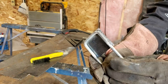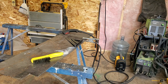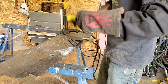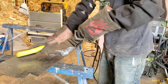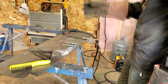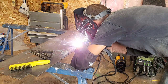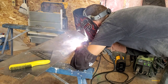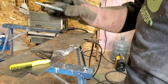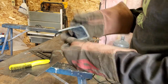As you can see, it gives you a decent weld — there's a little bit of frostiness in that weld there, but I'm going to go over it again just to strengthen it. I'll cool it down a little bit, then add a little bit more to the bottom. I'll take the flap disc and clean everything up, and be ready to start slicing the lines in and all of that.